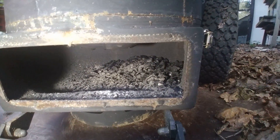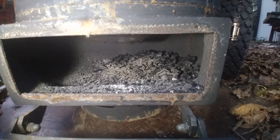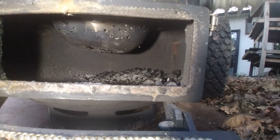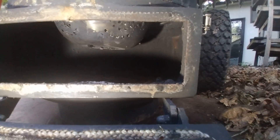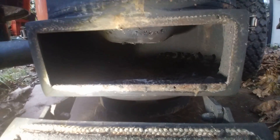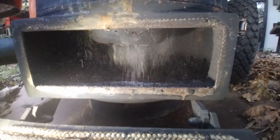Inside here you'll see that the ash from the previous burn is still there — I wanted to leave that in so you could see how much ash you get from approximately a two-hour burn. Up above is the ash grate, made out of a cooking colander, that holds a bit of ash close to the bottom of the embers to create what they call the reduction zone. Outside here we've got a lever connected to the ash pan — moving this agitates the grate and cleans out any excess ash.